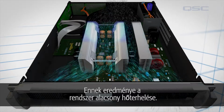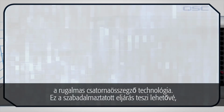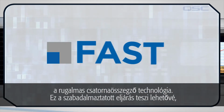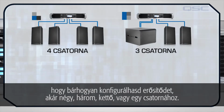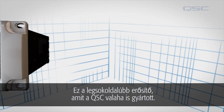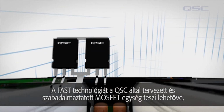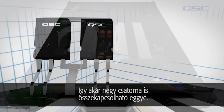One of the features that sets this amplifier apart from the competition is the flexible amplifier summing technology. This patent-pending technique enables you to configure the amplifier using 4, 3, 2, and single-channel amplifier configurations, making this the most flexible amplifier QSC has ever created. What makes fast amplification possible is this QSC-designed proprietary MOSFET, utilized in each of the 4 amplifier channels.